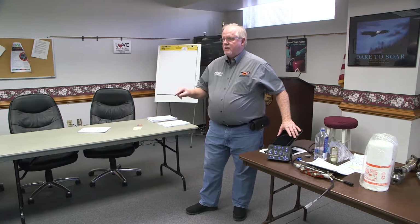If he can tell you which light's blinking, then it's going to tell you what circuit you need to look at. Assuming on the touch screen when you touch it, it turns green, right? Yep. But is it set to turn red if there was a fault, or does something else happen? No, if there's a fault here, it's actually going to pop up on the screen. A box will pop up on the screen and tell you what's wrong with it. It might not give you the exact pinpoint of where it's at, but it'll tell you what circuit it is, what you need to be looking at. It's a little bit more precise than just a blinking light.